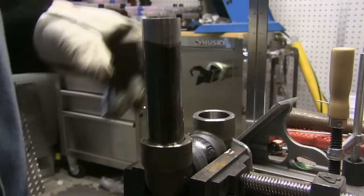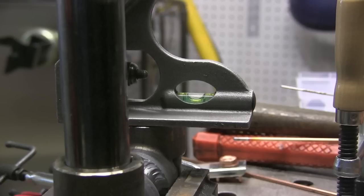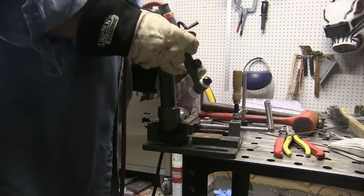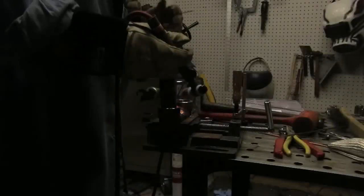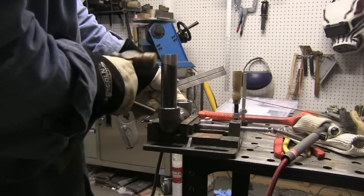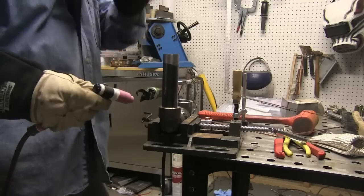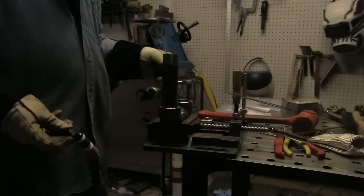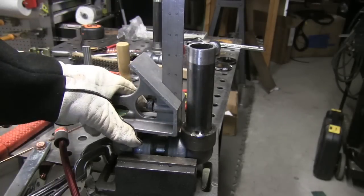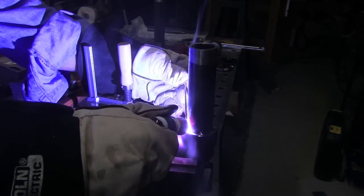Let's fit one up here. The first thing I need to do is get the fitting kind of level like that. If it's not perfectly level, just if it's just riding a line, that's fine — you just make the piece you're trying to match it ride a line also. I'm just tilting it back and that puts about a 1/16th or 3/32nd gap in there. Then it's a check it, bump it, check it, bump it kind of an affair with socket welds. Make sure it didn't move while tapping, then check it again. When that's square, get the second tack on it, then rotate around 90 degrees and do the same thing. This time I can just use the square riding on the fitting face. Then get the third tack and the fourth tack and we'll be ready to weld.